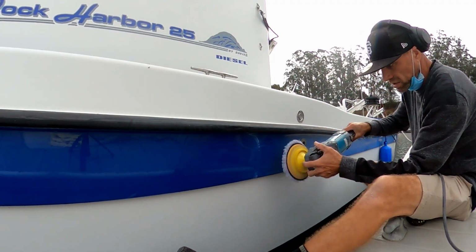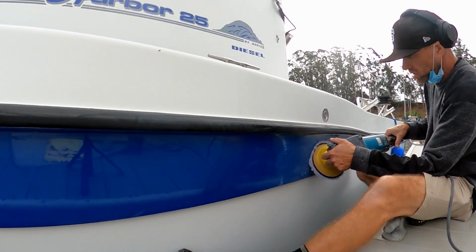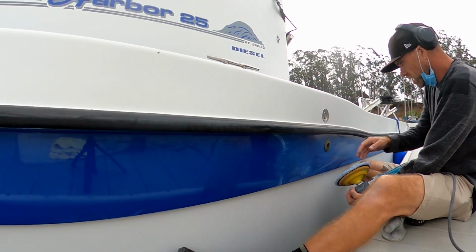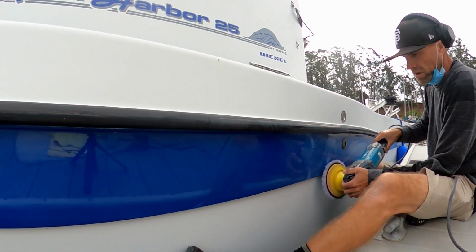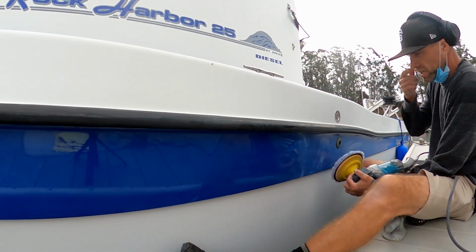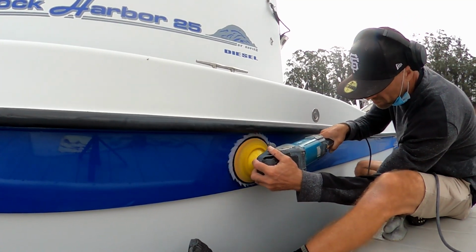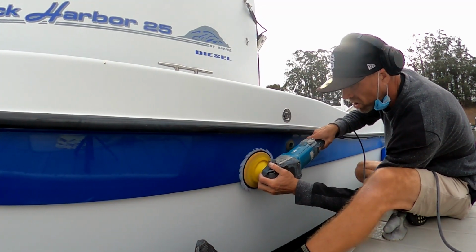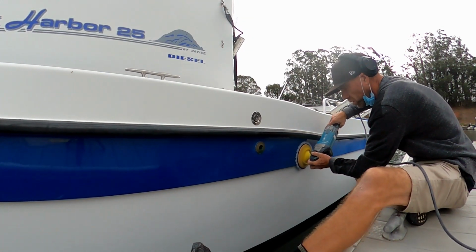And then I will do some pad tilting, and then to get in the corners and around, I'm going to cut in around this thing. It's going to touch, so this is going to get shiny. It's fine. It's just the naval brass stuff so it's no sweat. And then make sure you keep the pad flat as much as you can, especially when you're going to do your last pass and you're finishing down. You'll cut down on rotary marks or holograms. Don't want to push it too hard. It's regular. Just enough pressure to hold it.